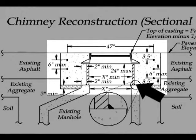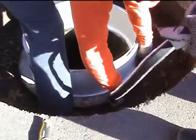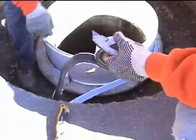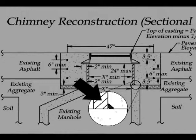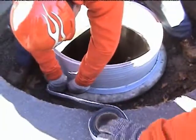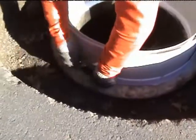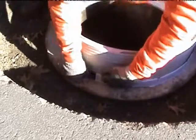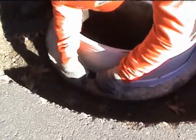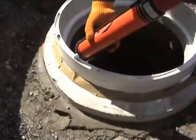The next thing we do is move to the water stop. We press it in — it has an angled edge on each edge, and you want to press those angles in so it's laying on a 45-degree angle. There's a little blow-up of the water stop; it should lay crossways like a 45-degree. When you wrap that bentonite around this repair, there will be a joint where the two ends come together — knead it together so that you've got a secure seal.